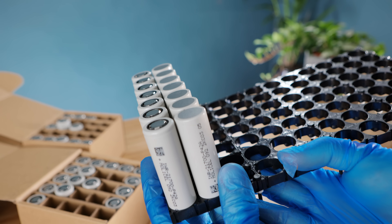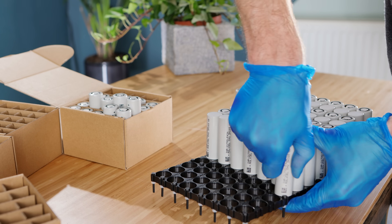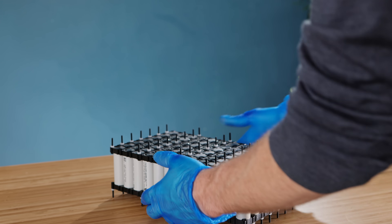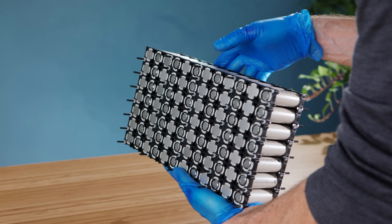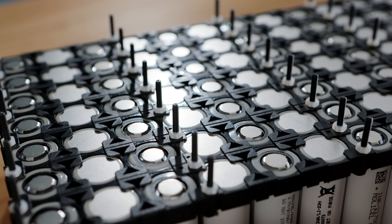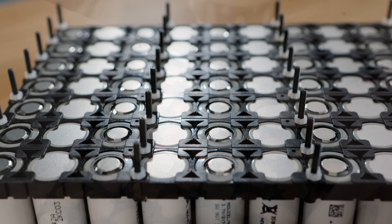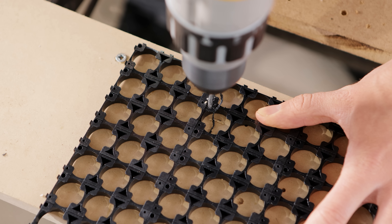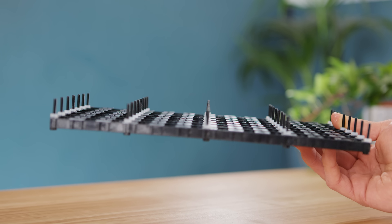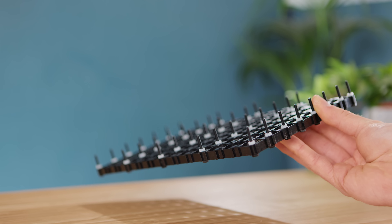The same applies to the second row, though they all need to be inserted the other way around for the purpose of series wiring in just a minute. This pattern can be repeated with the remaining rows until it looks like this. With the top spacers in place as well, the cells are all held together extremely securely. You might be wondering what the upright black rods are — they're actually non-conductive nylon bolts. I added these earlier by drilling some holes through the spacers and screwing the nylon bolts in place with some matching nylon nuts, and the idea is to use them for a very secure mounting method and electrical insulation system.